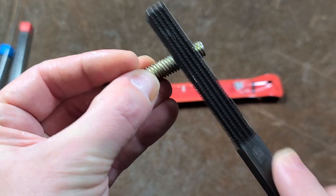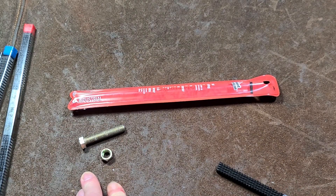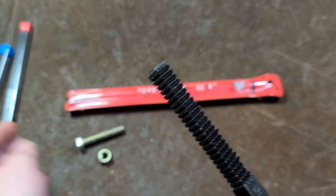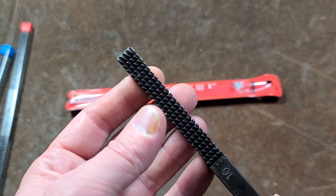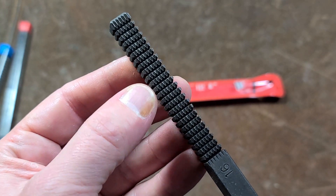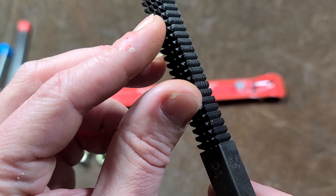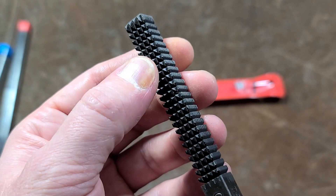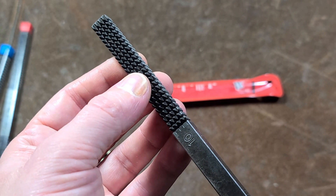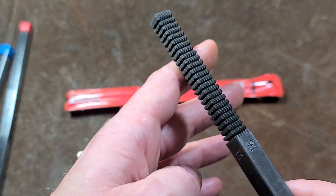It's always kind of been the disappointment with these — you can do all that, and many times it only helps somewhat. I think that's really the reason you don't hear about or see thread files that often: they're only somewhat effective. Most of this bolt the file will run just fine through, but the burrs are still more than enough to make the nut very difficult to thread on. So I just keep them for emergency situations where that's all you can do — try to remove the burrs and force the fastener in, knowing it's not as bad as it was. Also, under certain situations doing a normal filing operation, this is a toothed file, so you can use the coarse side to actually remove a ton of material very quickly — kind of like a very compact bastard file with a very aggressive tooth pattern.